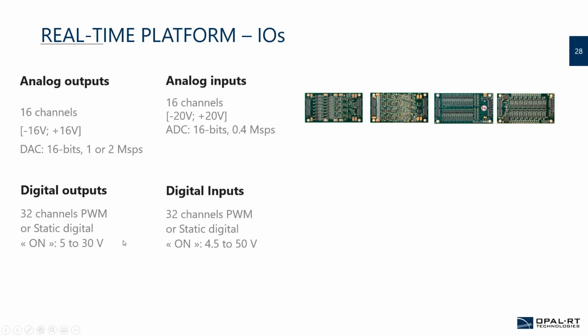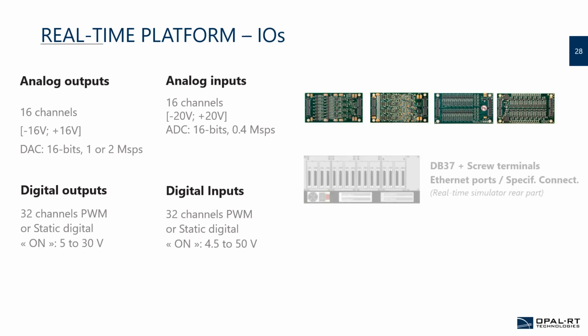Same thing for digital outputs. Usually people provide different outputs, but you want a mix of outputs that are really fast, like TTL, and also, if you want to drive a relay, which is really common, just TTL digital doesn't have enough current to drive a mechanical relay. So maybe you also want a set of digital outputs that have enough power to drive a smaller relay. So these are considerations you have to ask yourself on the IO type.